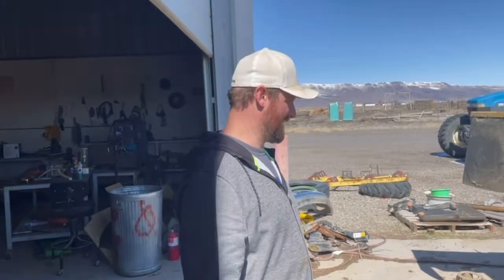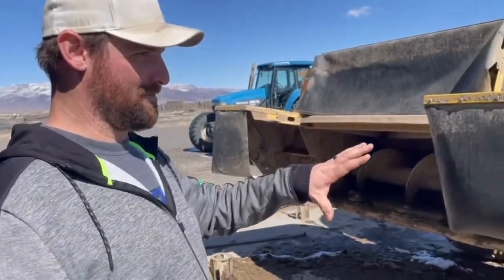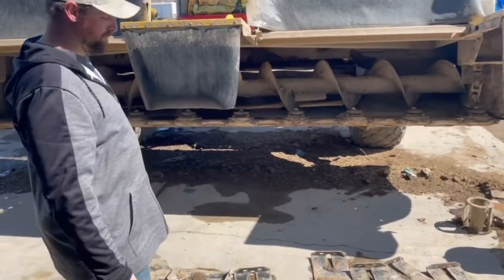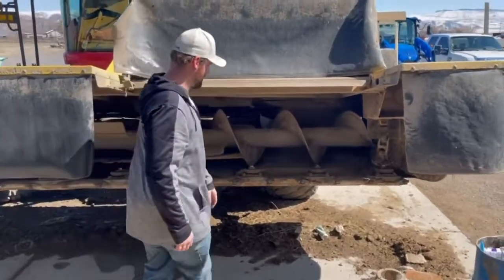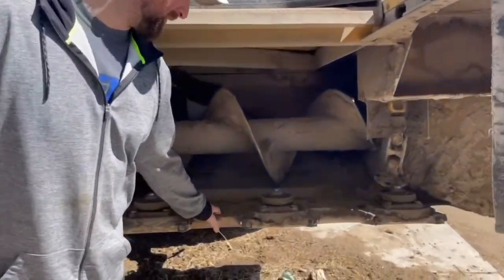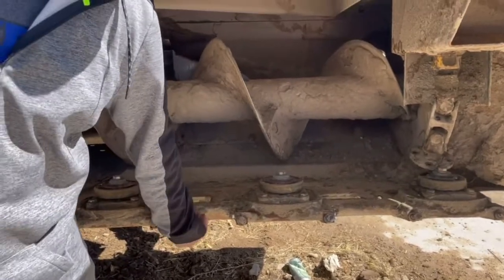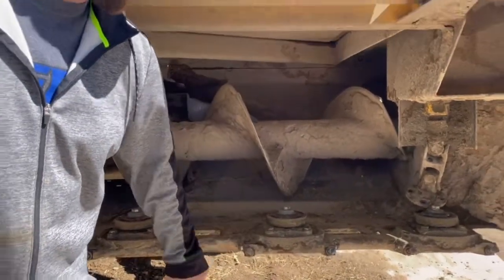We've been farming and stuff, but we had this swather torn apart. This is the 416 Durabine header, and we got it all torn apart because we're going to be redoing all the spacers and drive lines that are in between here. They don't necessarily need it, but some of these are getting kind of thin. I don't like letting them get so they get full of dirt.